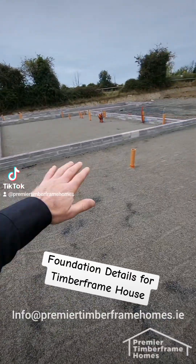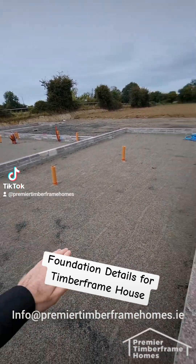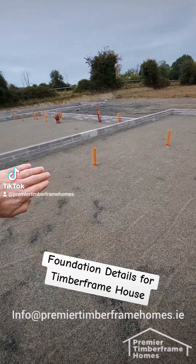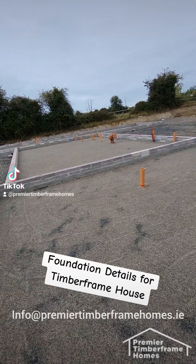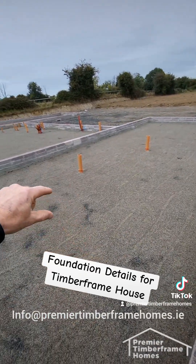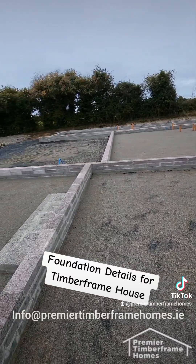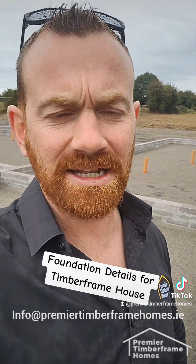On top of it you put a little skim of sand all the way across, because the next stage is putting down what's called a radon barrier. The radon barrier goes over the block, down and across and back up, right throughout the house. Because there are three sections to this house, there's a radon box in each one — the radon box has pipes coming out of it that let any buildup of radon underneath the house escape. That leaves us ready for the timber frame house, which we can have the complete shell up within three weeks from practically this stage — weather-tight and ready to go.